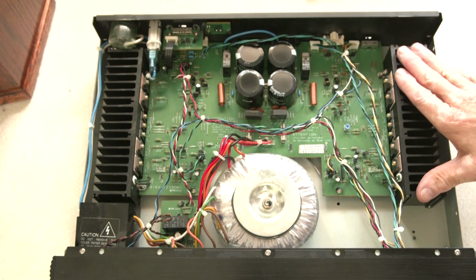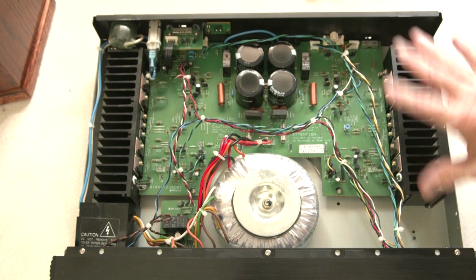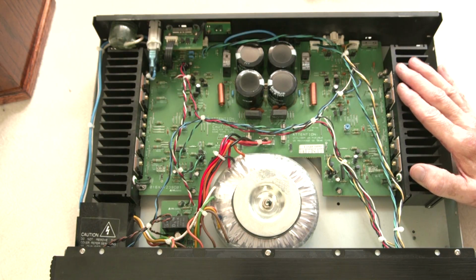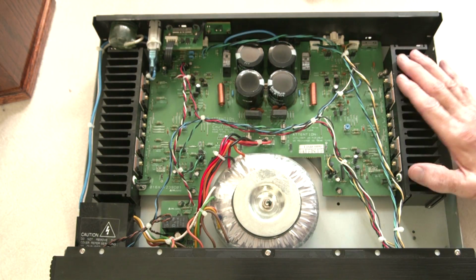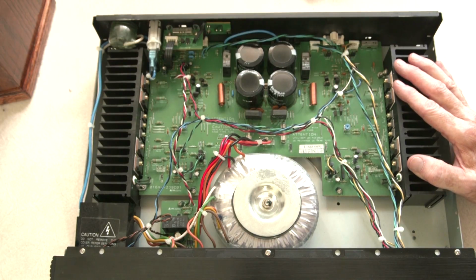to the heat sink. And now the heat sink gets warmed up, and there are vents underneath the steel chassis that allow air to rise. So these heat up, air rises through the vents at the top, and air goes underneath and goes through. You don't really need a fan. Some amplifiers, well, a fan would be noisy, I don't know. Computers have heat sinks on their main processors that actually have a fan on it, because it really gets hot, and you've got to keep it cool constantly. In this case, it's a more passive arrangement. They heat up, the heat rises, and the air flows that way. So that's basically it. That's all there really is to an amplifier.